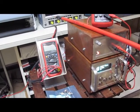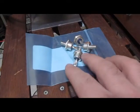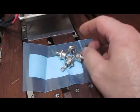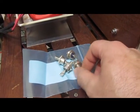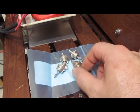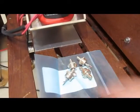Last time I was using the generator I damaged it. These four diodes here are all shorted. I've gone ahead and replaced these. I'm using five diodes now to increase the safety margin. I've also added two layers of protection for the new ones, so hopefully those won't fail again.